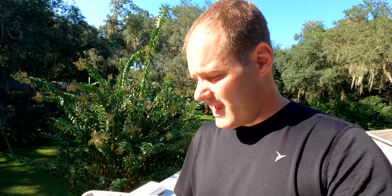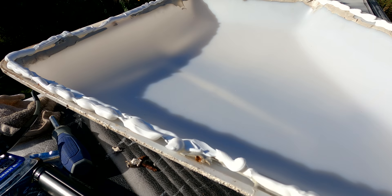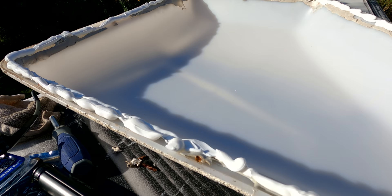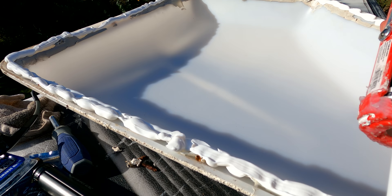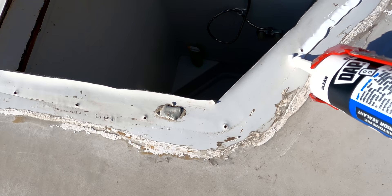What we need to do is take some clear silicone and go right along the inside of the skylight. I'm just going to put a little bit extra on here and then clean up anything that bleeds through. We'll run a little bit along the edge right in the middle, just one line right along where the nail holes are.